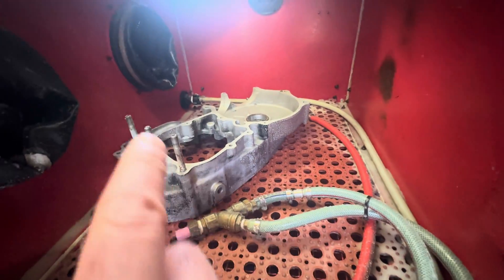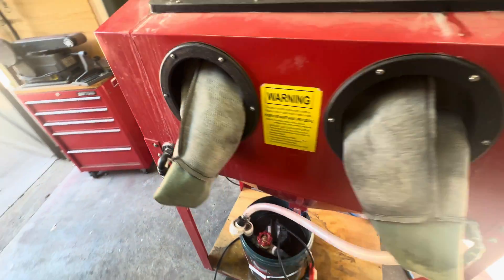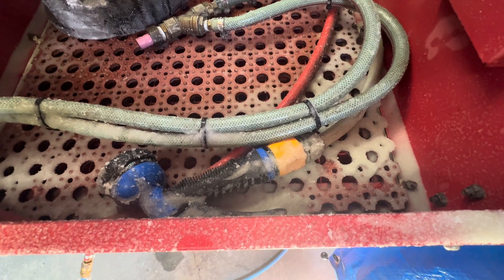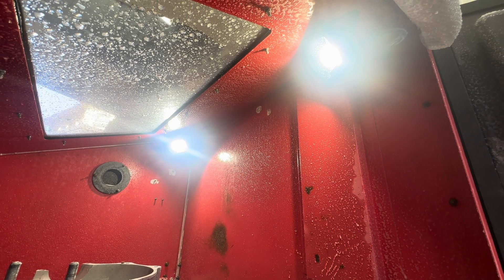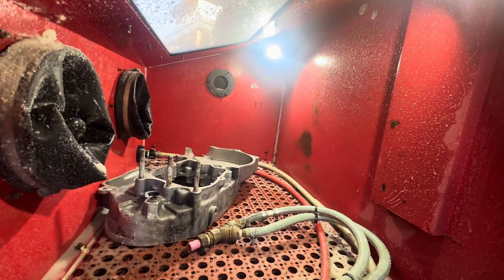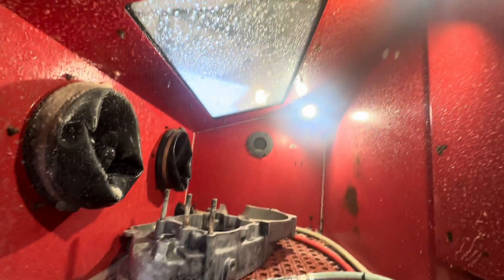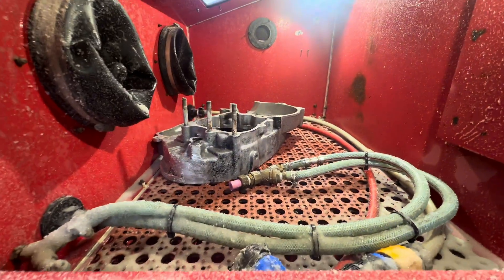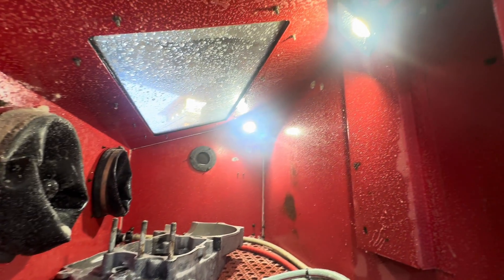There's also a hand gun from a hose that runs around to the other side of the cabinet. I've got an inlet for a regular garden hose so I can wash the inside of the cabinet out just with a garden hose. I'm about to do a media change and give you a demo of how that works. Inside the cabinet with the lights on - they're just two little 240 volt LED lights, I think they were 20 bucks each at Bunnings and they give off plenty of light. There's no fancy wipers or screen cleaning - I just get the gun and blow some slurry over the glass to rinse it off. A closed loop would be awesome but more complicated to set up. This works fine and gets the job done.